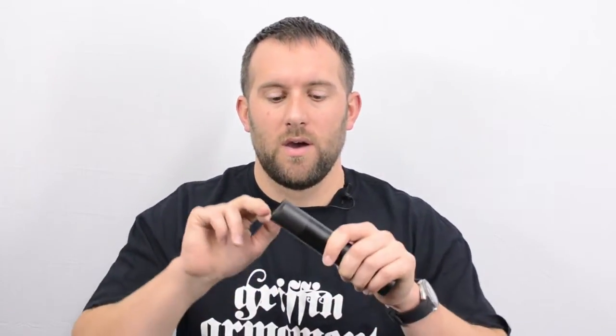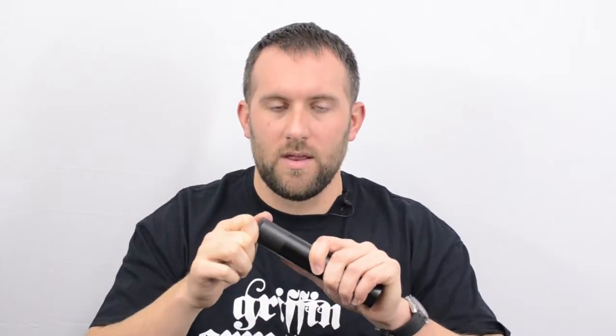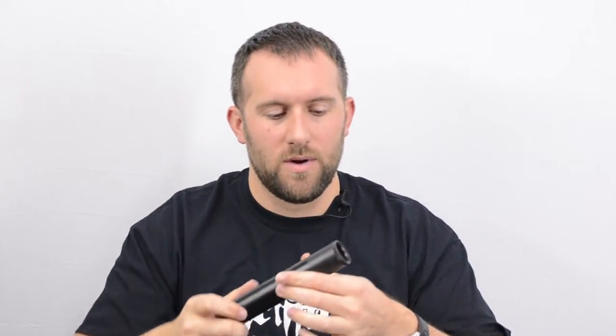If you're a sub gun user and you're going to have a high volume of fire, you want to use Loctite 2620 on those same two joints where applicable. That has a 650 degree thread locker rating. In either case, when you're reconfiguring the suppressor you'll need to heat the stainless steel components to that temperature and use a silicone glove or something like an M60 barrel mitt to remove the components from the silencer to reconfigure.